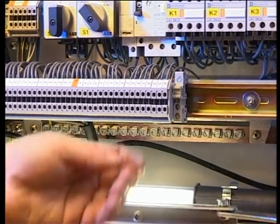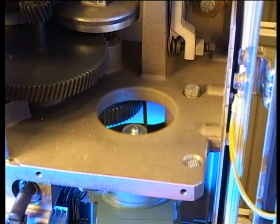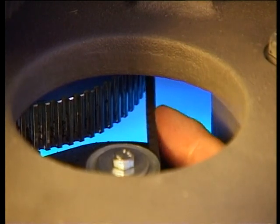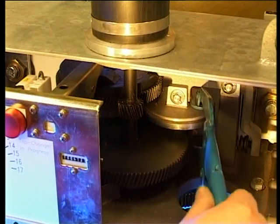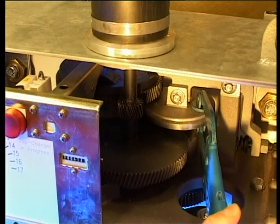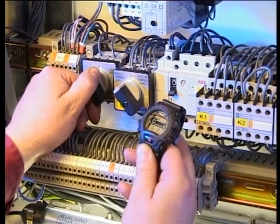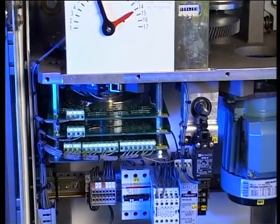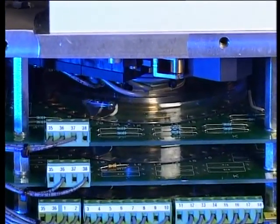Check that the element is working. Check that the drive belt tension is sufficient. A load of six newtons should press the belt in two millimeters. Lock the mechanism with the disc brake when the brake arm roller is in the slot in the cam disc. If there is a time relay, disconnect it. Clamp the disc brake together with welding tongs. When you try to operate the tap changer, the motor protection should trip within 60 seconds. Check the operation of the contacts in all positions with both lower and raise switching operations. You cannot adjust the contacts.